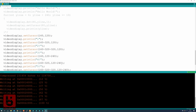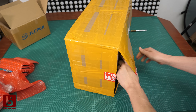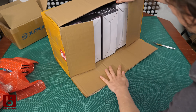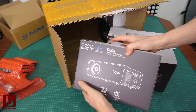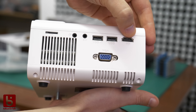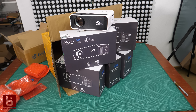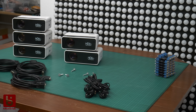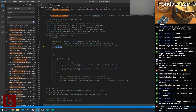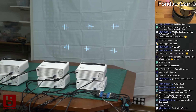The upload worked flawlessly. Now, where do we get six displays with VGA connectors? Thinking of all the possibilities I could do with six displays — like a holodeck — I simply purchased six LED projectors using supporter money. These are only $70 each and have all the connectors we need; the 720p resolution is also high enough. I got the VGA cables from eBay — I can only imagine the sellers were surprised someone bought all their inventory. With Martin's improvements to my old VGA library, all we needed to do was expand the GPIO matrix configuration, and it worked.